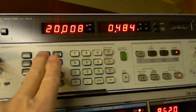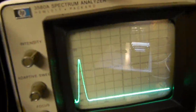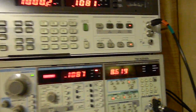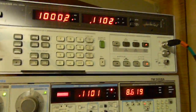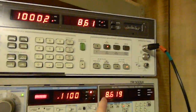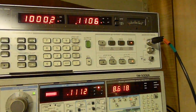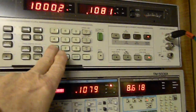If I want a frequency I can just say frequency 1 kilohertz — there's my 1 kilohertz. It agrees down there with that one, and there it is on my spectrum analyzer. There's its THD — and the Tektronix 501 agrees on THD as well. If I go to AC level, there's the AC level between the two that are the same. Now going back to distortion.